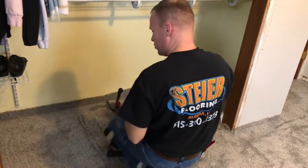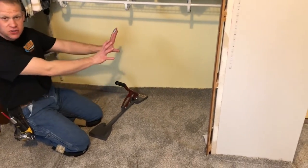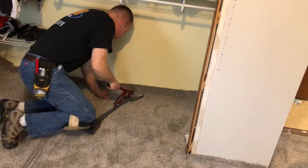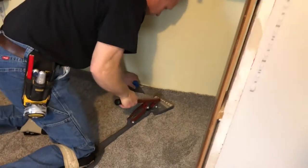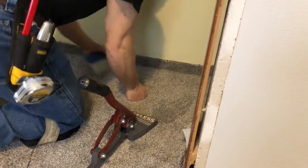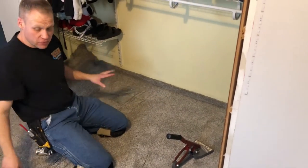It also lowers the chance of smacking your head into something in the closet, or scratching your back. As I've gotten older, it's all about slowing down. I've got a wrinkle — I could pull that back and manually push it out, but instead I'll use the tool. Be careful because if it snags just right it's going to start tearing out carpet fibers. Wrinkle's gone. I don't like the word 'stretched' with this thing — it's a misconception. I'm not stretching the carpet; I'm setting the carpet in there, and I want everything flattened out prior to that, set on those pins.